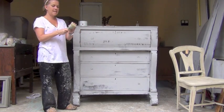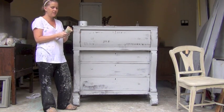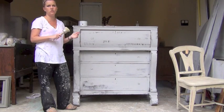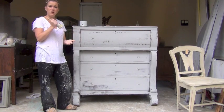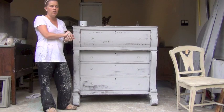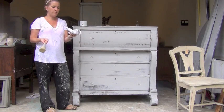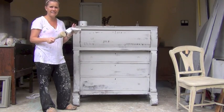So I take my Annie Sloan Wax Brush. A good tip: once it gets cakey — I use it on several pieces and then it starts getting a little cakey — the best thing to use is lye soap, L-Y-E. You can buy a bar of it at your hardware store. If it doesn't come off just by brushing the soap on, what I sometimes do is soak it in a bowl — goop up the soap and make it sudsy, put the wax brush in there, leave it overnight or a few hours. When you come back, you can literally just flake off the wax. You really do need a wax brush because if you use a cheesecloth or a buffer cloth, it's much harder to get into those cracks and get coverage.